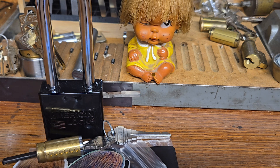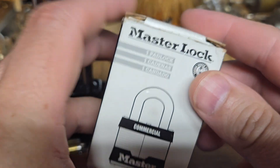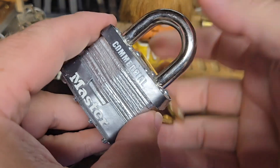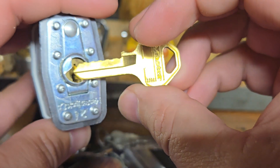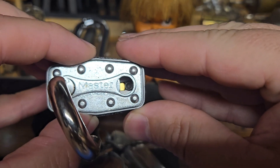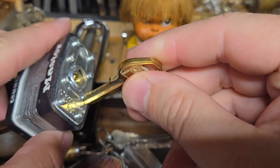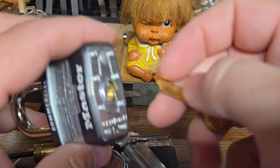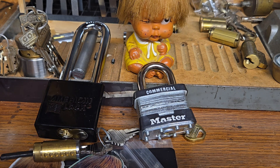I'm going to add one more fun thing into the giveaway — a Master Lock commercial padlock. This thing is pretty neat. It's zero-bitted, so you guys will have to cut the key and pin them yourselves. They open up nicely: take out the Allen head hex screw, the core slides out just like an American Lock, put your key in, turn it 180 degrees, the pins fall out, and you can cut the key to whatever cut you like. Each winner will get one of those as well.